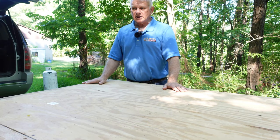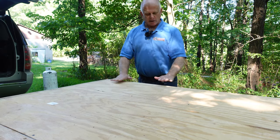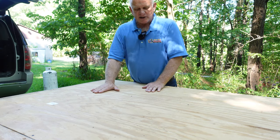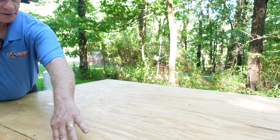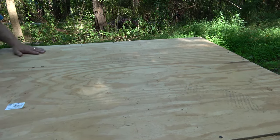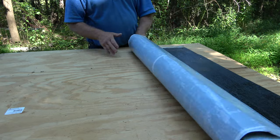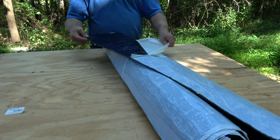So the cover of the well that I'm going to roof now — I'm going to use torch-down. First of all, you have to cover this plywood with a base. You cannot just torch straight over the plywood. I've done it before and it's not a good idea because the flame can go through the joints and catch the insulation on fire. So you don't want that. The simplest way is to put a self-adhering base. You see — it's very sticky, it's tacky. It sticks to my hand.